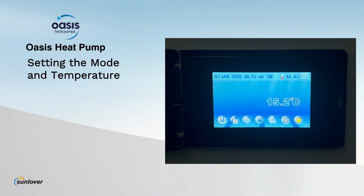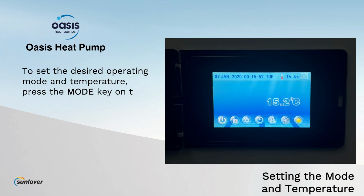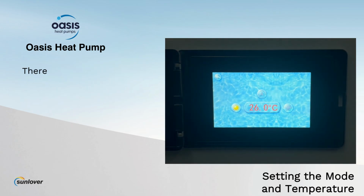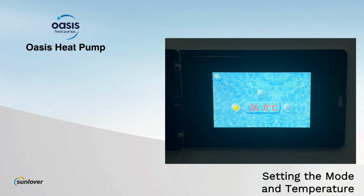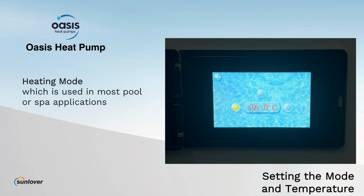Setting the mode and temperature. To set the desired operating mode and temperature, press the mode key on the right-hand side of the screen. There are 3 mode icons which allow us to cycle between them. Heating mode, which is used in most pool or spa applications.